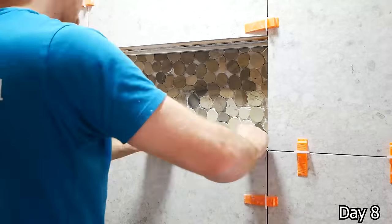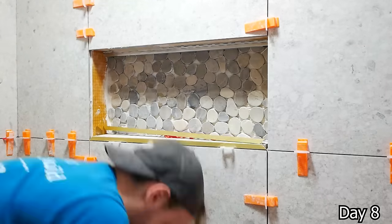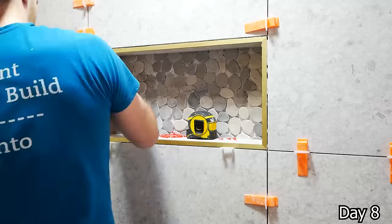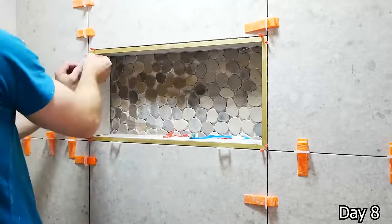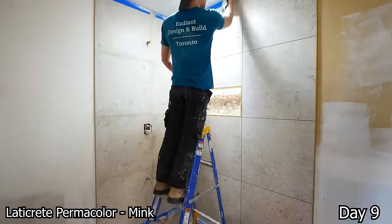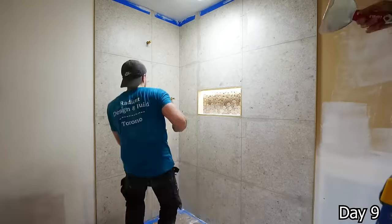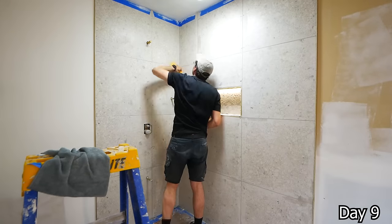You can see here we got the gold trim going in to match with the rest of the fixtures, getting that bottom piece just pitched ever so slightly outwards, and really making use of these little red wedges to get perfect grout lines and get the miters on those trim pieces really, really tight. For the grout, we went with Laticrete's Mink, just a light gray, and matched with the tile really nice, both the river stone as well as the porcelain terrazzo kind of tile that we had for the walls in the